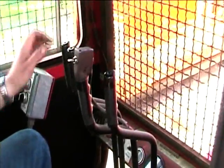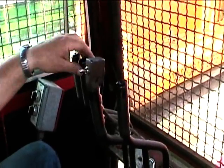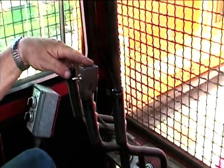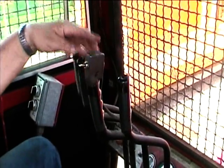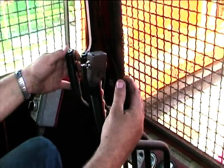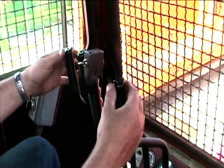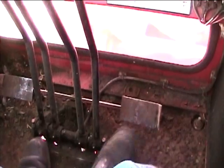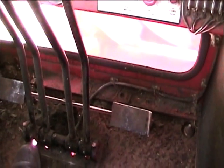You've got four handles up here which operate the boom and the grapple. The center two operate raise and lower on both sections of the boom. The two outer ones operate the swivel and the open and close on the grapple. Down here are the foot pedals — they move the entire grapple and boom unit left to right. Left goes to left, right goes to the right.